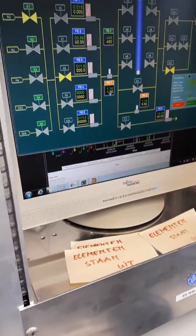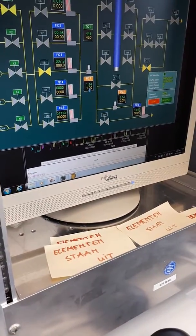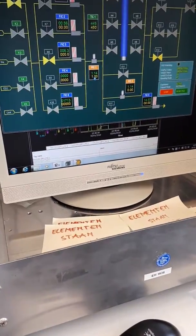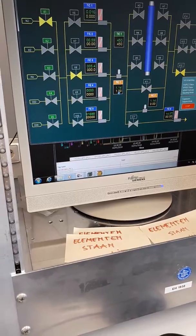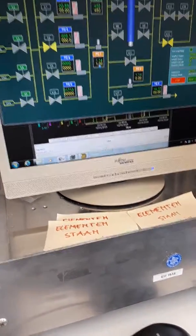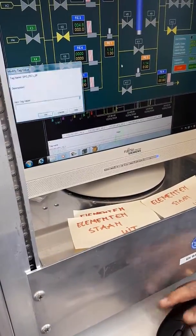That's quite tight because that's a palladium membrane. I know, and with palladium and nitrogen, it's like 100% separation. So to release the pressure will be a lot of work. It won't be leaking because the pressure doesn't fall down. In this, the 1 bar pressure? Yeah, because you can see that the pressure is not falling down at all. You see? Yes. So for me, that looks like a very good membrane.